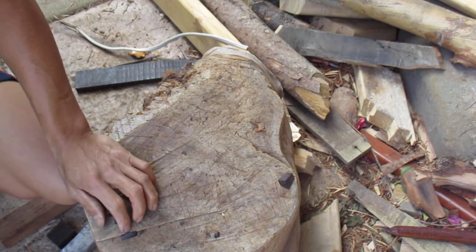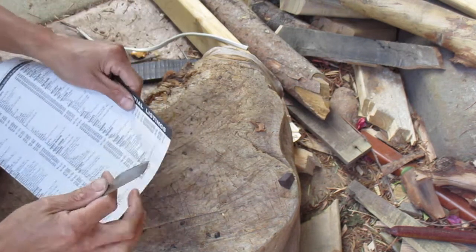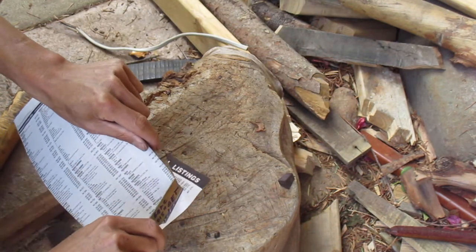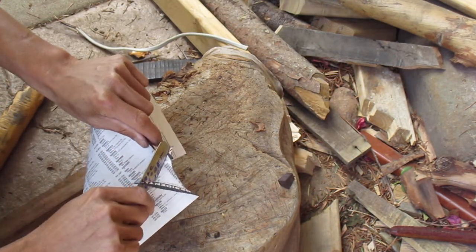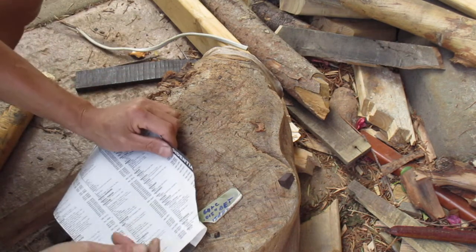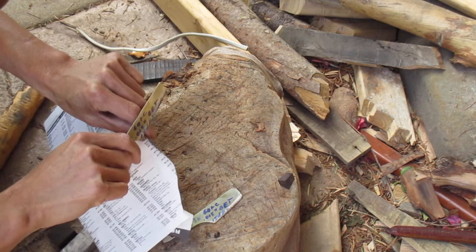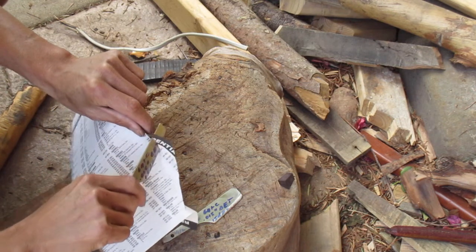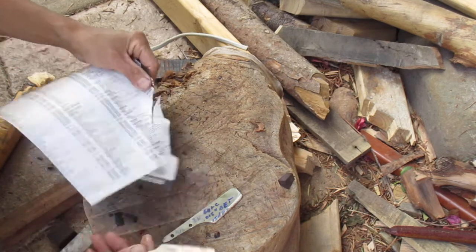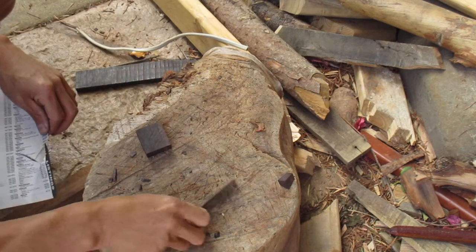Let me check the newspaper slicing for the 3V and the D2. You don't see anything that catches and tears. That means if you have a chip, it will catch the newsprint and tear. So it's still no edge damage for this edge geometry.